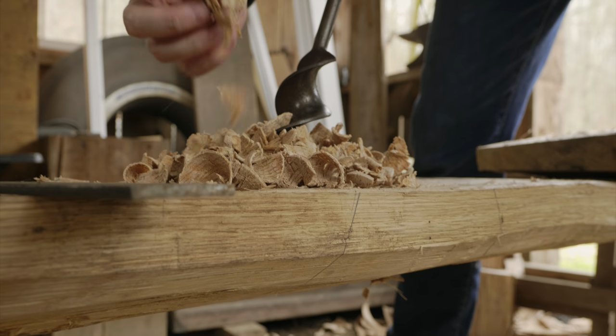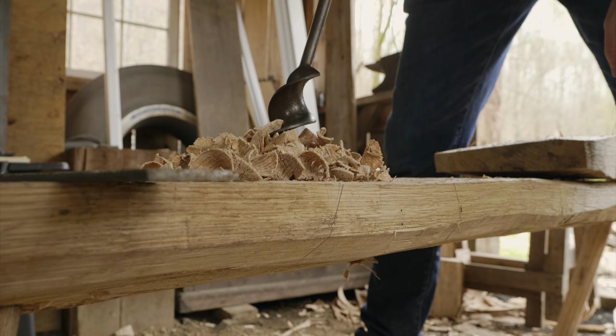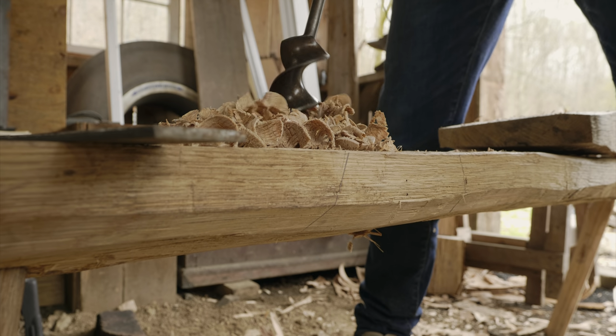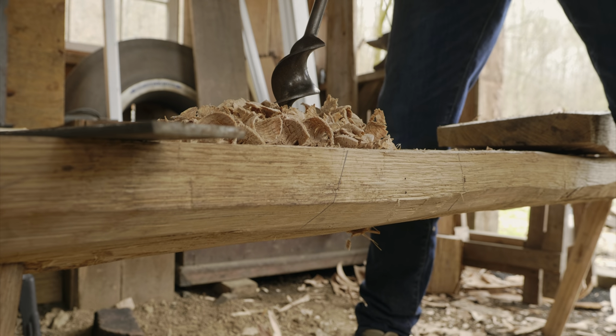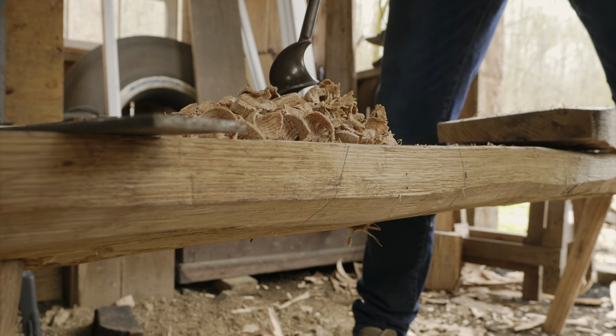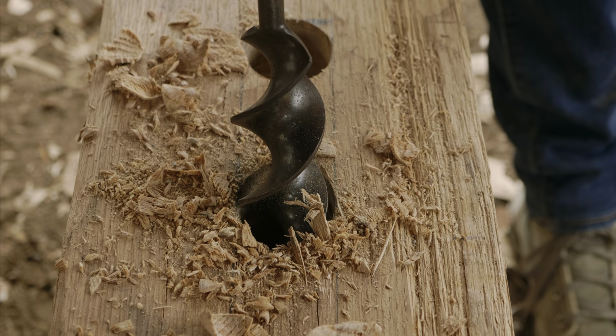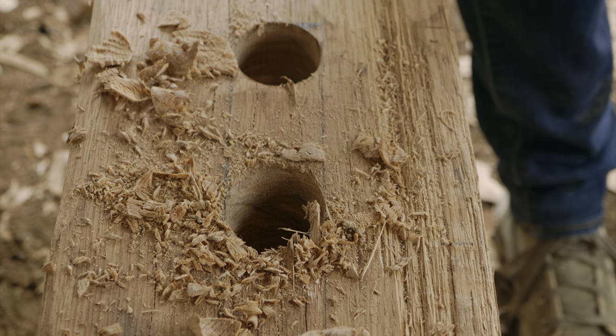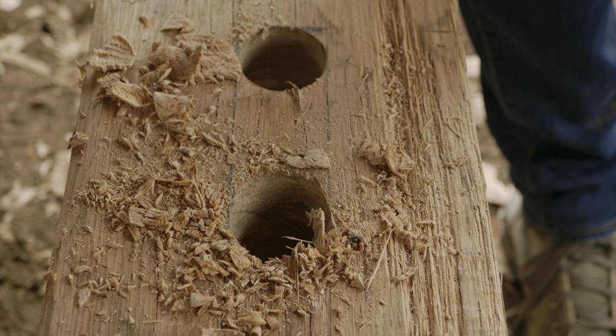It's kind of crazy how thick these are. Yeah, they're over a 16th thick. That is set by the lead screw, the screw on the end that draws it in. The pitch of those threads determines how fast it cuts. Cool. But you definitely want to be doing this sort of thing in greenwood, if at all possible.